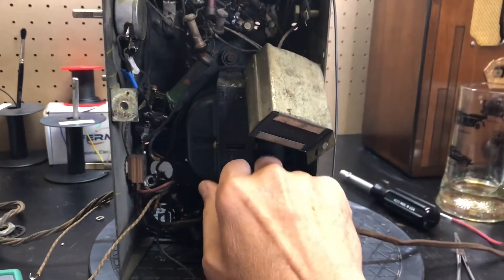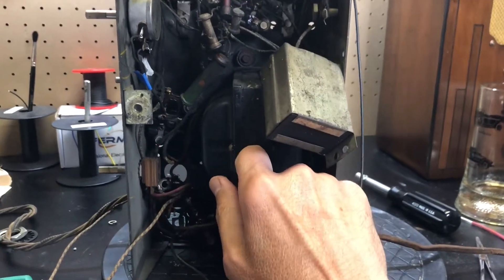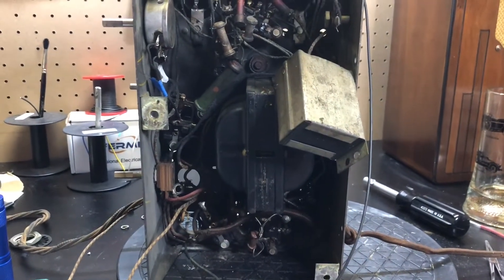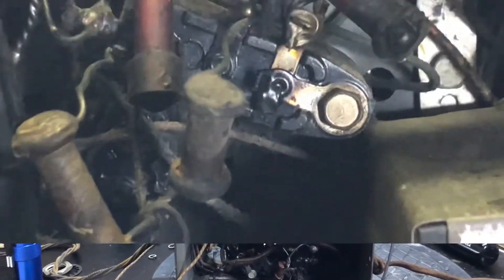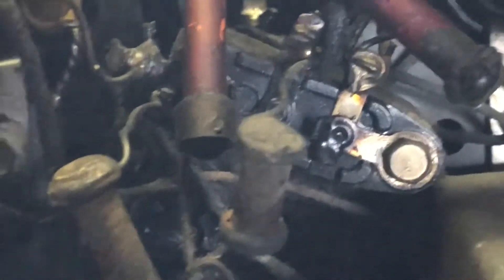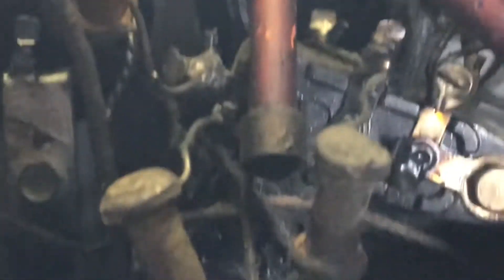It's been a good 30 minutes since I saw the smoke. The transformer you can still feel is a little bit warm — that's not a good sign. This may be a display item. A lot of these capacitors look super heated; this one has a lot of tar melted out of it, dripped on this resistor, and there's a hole underneath with a burnt look. A lot of overheated parts.